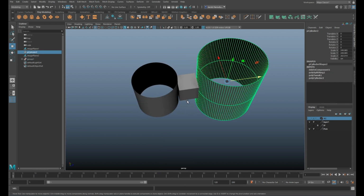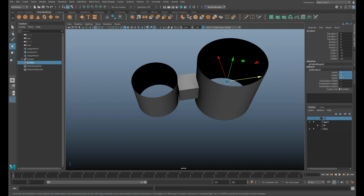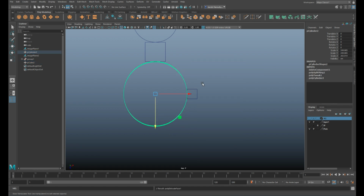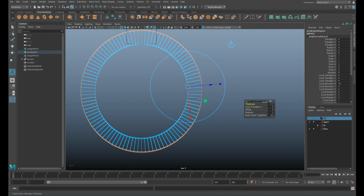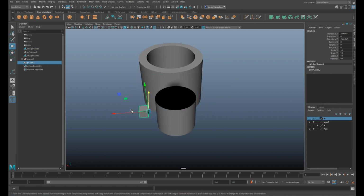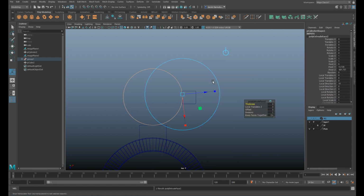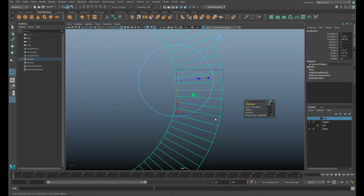Now with that in mind, I'm going to create a thickness of these walls at 8 millimeters, so it's nice and sturdy. I'm going to grab my measuring cube again. I'm going to go 8 millimeters. I'm going to go to the outside here, and I'm going to extrude this. I'm just going to increase the thickness here to the 8 millimeter mark. Very nice. And likewise, I'm going to do the same for this. And I'm just double checking with this measuring cube because I noticed that when I extruded, I was able to just click 8 and it gave me the exact measurement I needed.